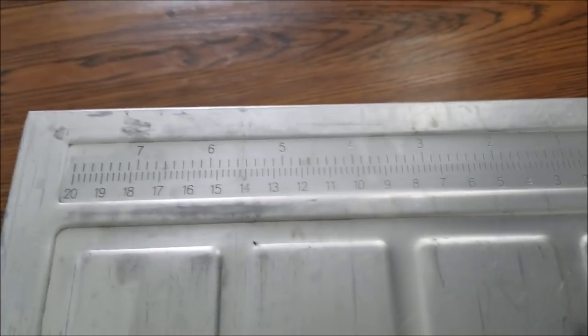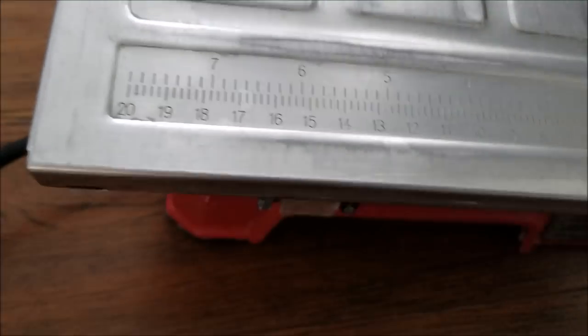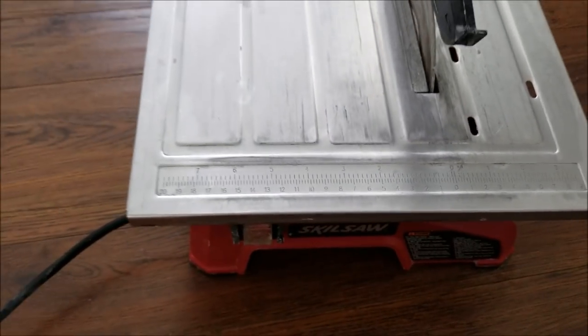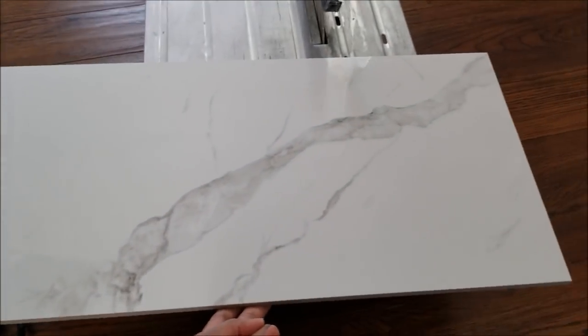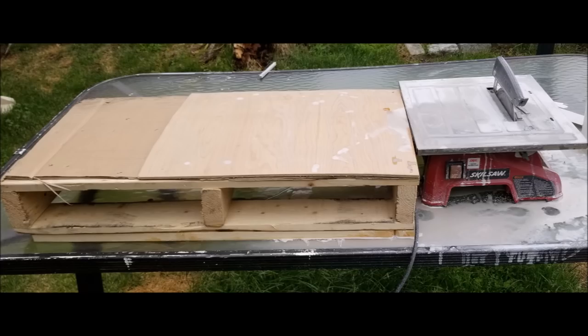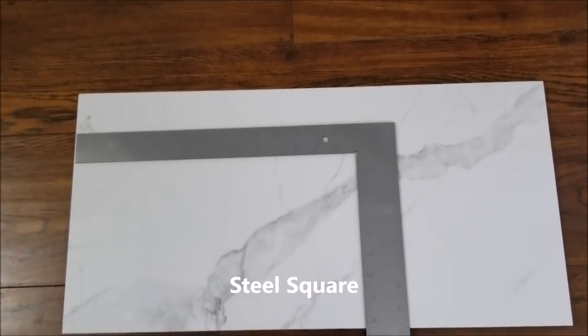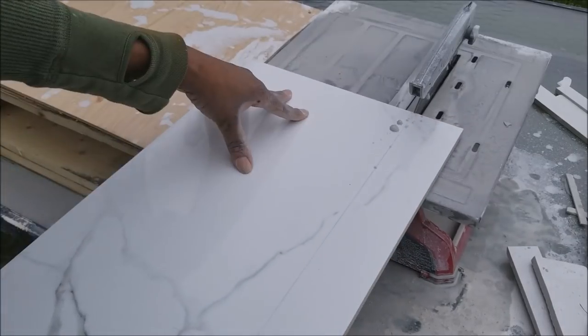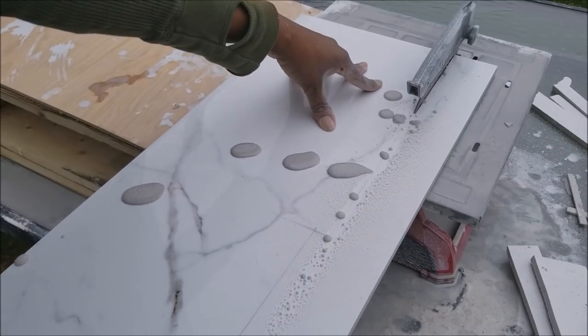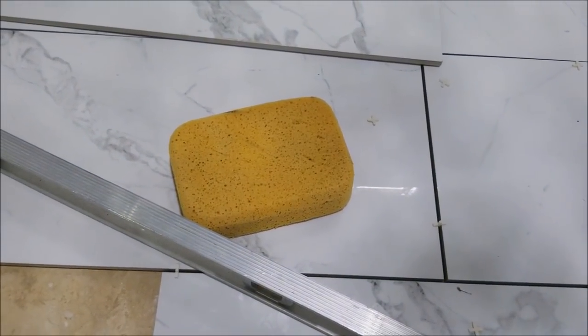But I'm sure you might have noticed something by now — you have seen the size of the tiles I've decided to use, and you are now seeing this tiny little tile cutter. Yes, it's not going to cut it. So I ran to Home Depot to rent the larger one, but that thing weighed about a hundred and fifty pounds and I was in no mood for that. So I kind of made my own little retrofitted box thing — built it up to the level of the tile cutter so the tile can rest on it while I slide it along to cut. Then to ensure I'm cutting a straight line I use this ruler to draw the line straight, and the wall on the saw keeps the cut straight.